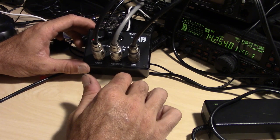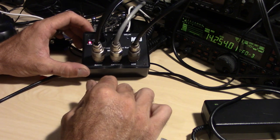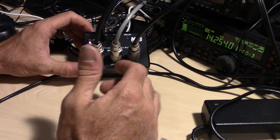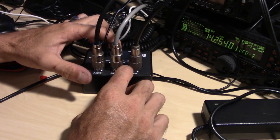If you don't have power in there, the relay is going to set to transmit, so it might be acting quirky. Make sure you have power in that. It's not drawing a lot of power, so if you wanted to take this portable with a battery with your QRP rig or whatever, you can do that. It's not requiring much power at all. And then your PTT line here.